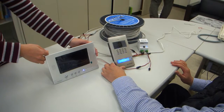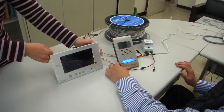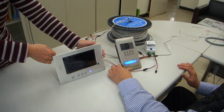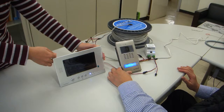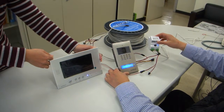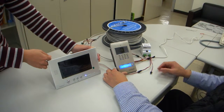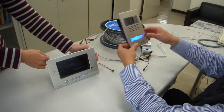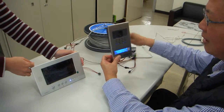This is the 915 two-wire system for a single house. We show a one-to-one setup: one camera, one monitor, and one power supply. The wiring is very easy — two wires from the power supply to the camera, and two wires from the camera to the monitor.